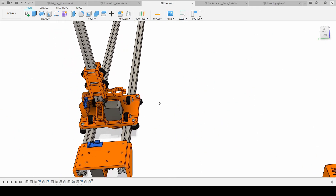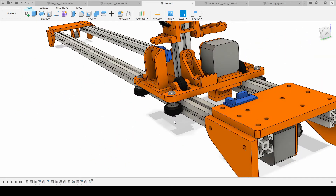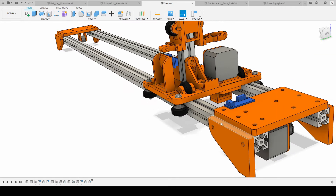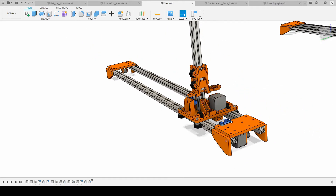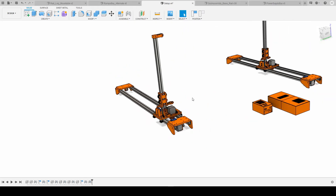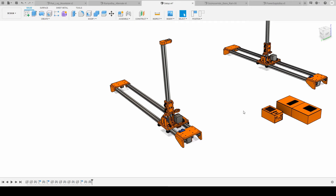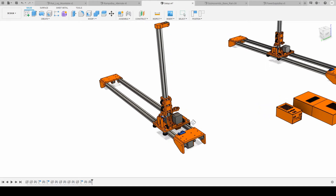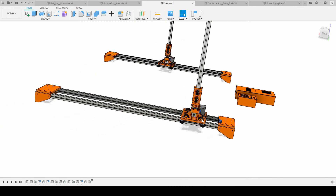Each gantry uses wheels on bearings for moving across extruded aluminum pieces, and are pulled with two millimeter pulleys. I got all the pieces from — I think it was Open Parts or OpenBuilds — I'll put a link in the description. I also have a bill of materials that I'll put below, though that might still be in progress. The main idea is that a nichrome wire is held between each of the gantries, tensioned by some springs, and then it's controlled...